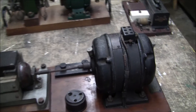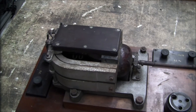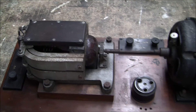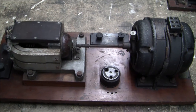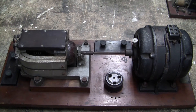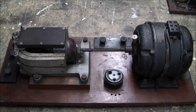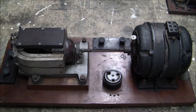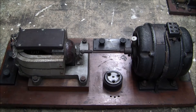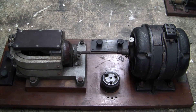Really what you have is an AC motor coupled to a DC dynamo — that's pretty much it. Very basic. But they were kind of reliable, probably nothing like as efficient or reliable as a diode-based system or probably mercury arc rectifiers. But very simple in theory.